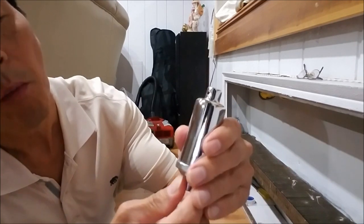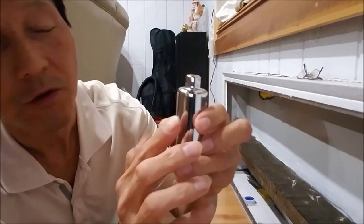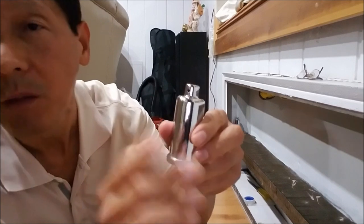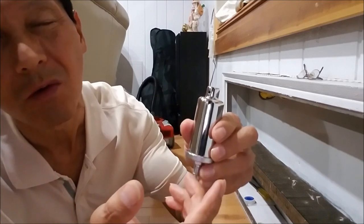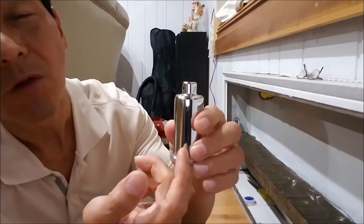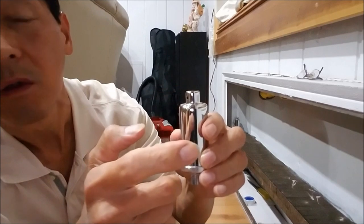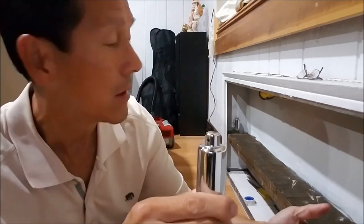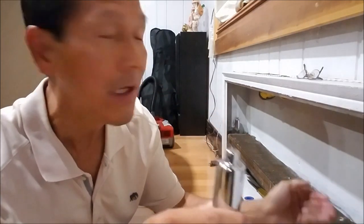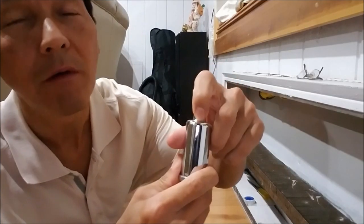So normally inside here you have the needle valve. At a certain steam pressure, like maybe 3 pounds or 4 or 5 pounds, the needle starts lifting up and opens up and lets the steam escape through the hole. That's why you see the radiator getting hot and heating up your room. If this hole doesn't work, you never get heat.